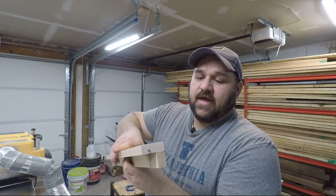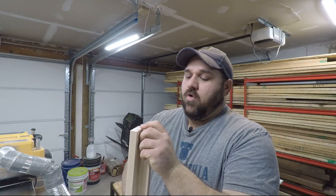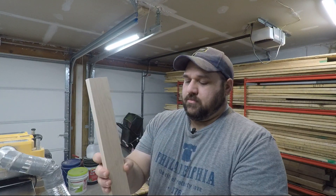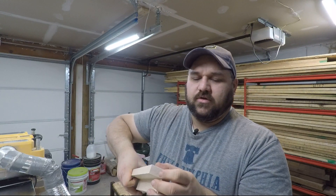I'm also going to be joining two pieces together for the corners. This piece and this piece will go together and form a square like that — that will be the corner. The other pieces are going to come off here. This thickness is the same as this thickness here, so it'll look like one solid piece of wood. You won't actually know that it's an L shape. So I've got a lot of holes to drill, and I'll join the corner pieces together and then go from there.